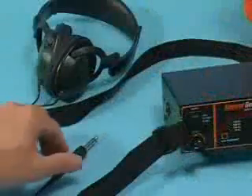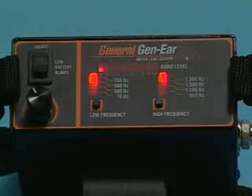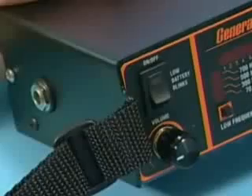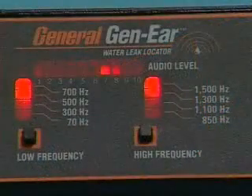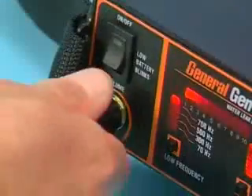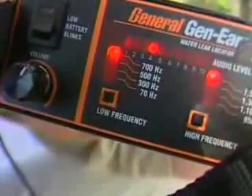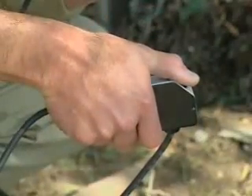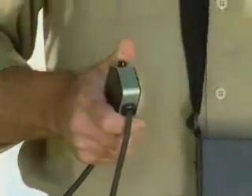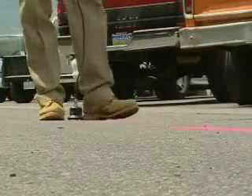To operate your Gen Ear, begin by plugging the headphones into the digital spectrum analyzer. Next, turn the power switch to the on position. The power light blinks when the batteries are low. Note: the system automatically shuts off when headphones are removed. Caution: the Gen Ear has a high level of audio output. To avoid possible damage to your hearing, always start with the volume control at the lowest setting, then proceed slowly, adjusting upward for maximum sound. Depress and hold the handle safety switch to listen to the sound from the sensors — this switch protects the operator from sudden loud noises by muting the sound when the button is released. Remember, do not press the push button while the sensor is in motion.